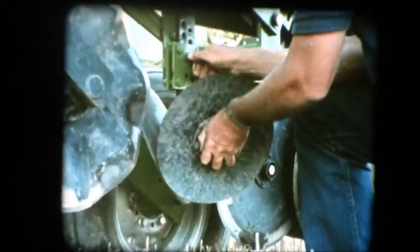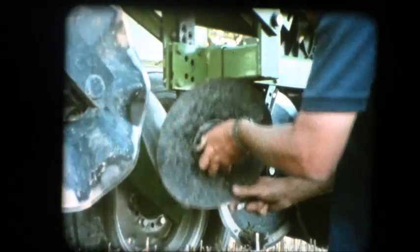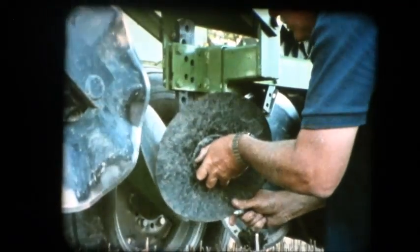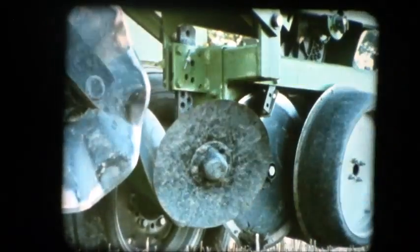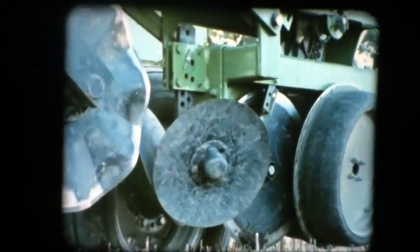Other popular options include the 12-inch disc furrowers. They move trash aside and break up dry, crusted soil, and help to level the tops of elevated seed beds. Just pull one pin to change depth or to remove a disc. The disc furrowers greatly increase your planting options, and all these accessories let you choose the tillage method that works best for you.